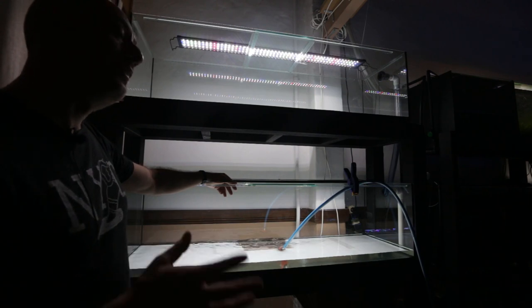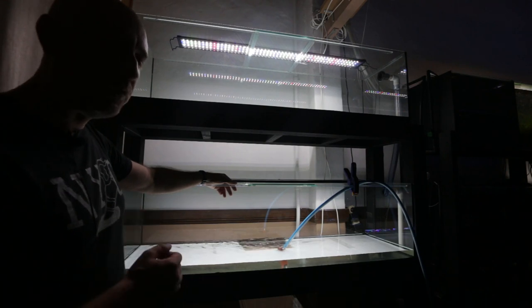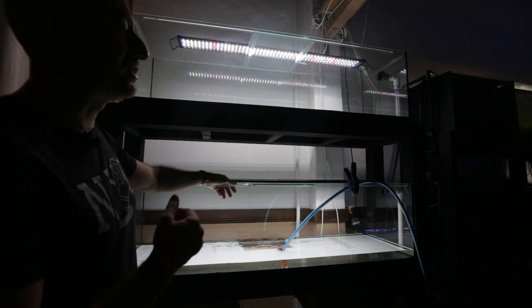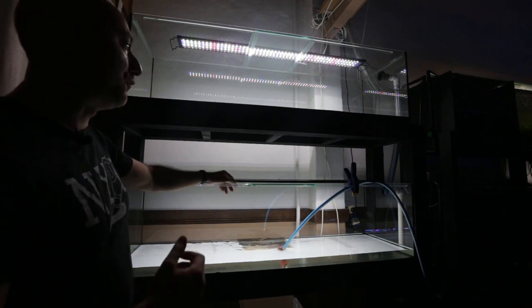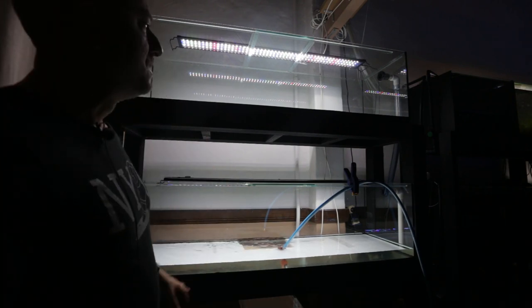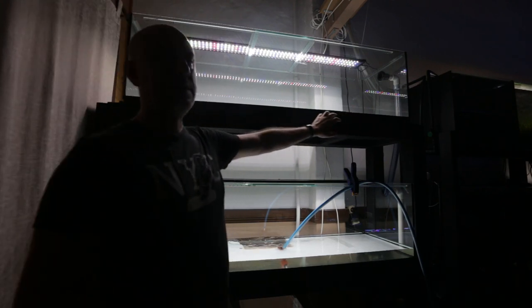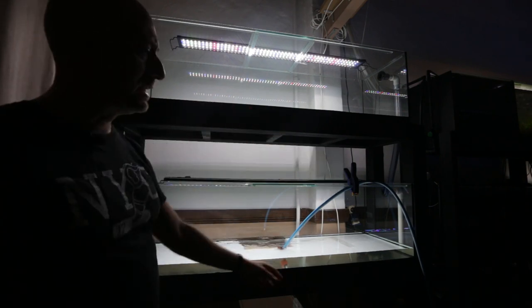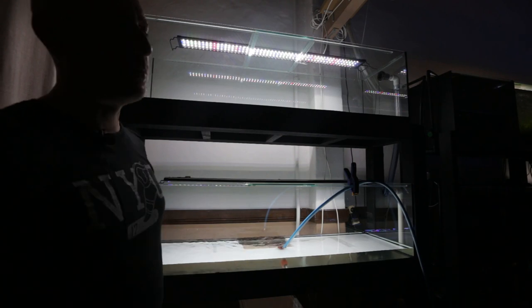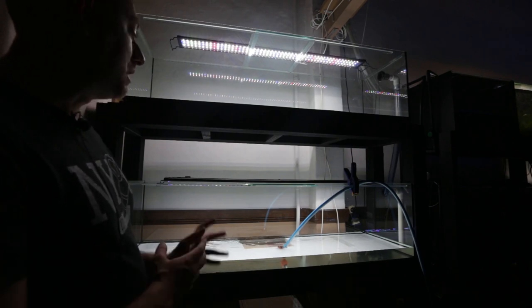Get that water ready to go. Then when I'm ready to test the PVC cement job I've done on my plumbing, I'll finish filling them up — I just have to raise the water level just above the bulkhead and that will complete the circuit from this side of the fish room to my sump system on the other side. You may also notice you can't see the polystyrene underneath the tanks anymore — I've put black electrical tape on the bottom to hide that white line and make it a bit neater.